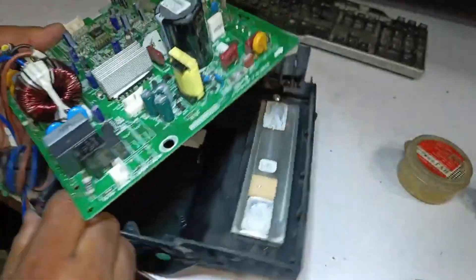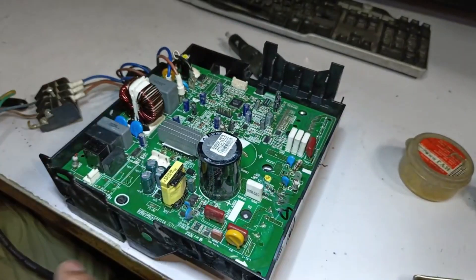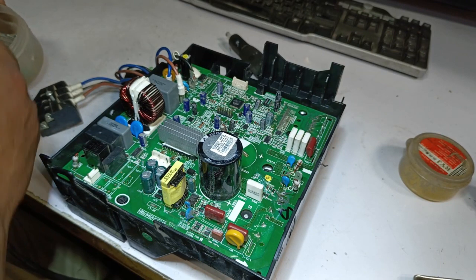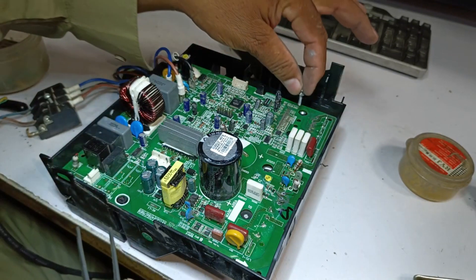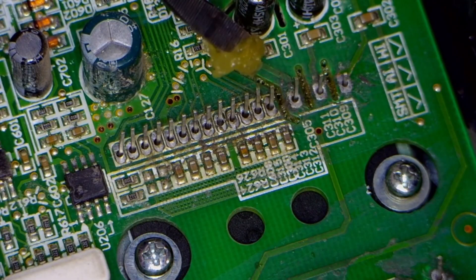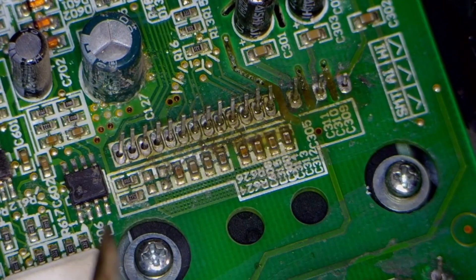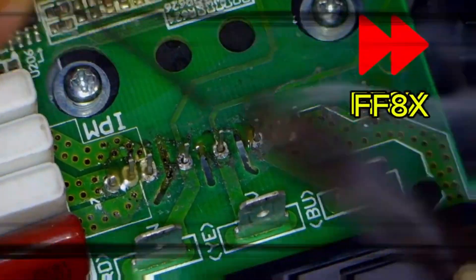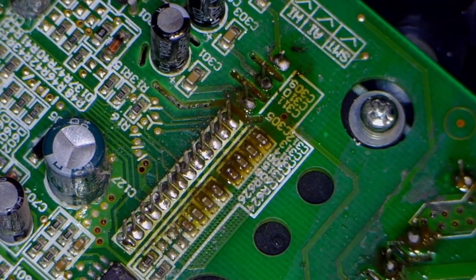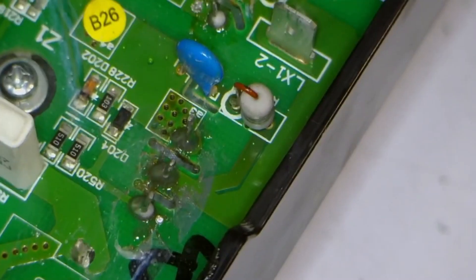I have placed the diode and IGBT back in their positions, so we will now reassemble the circuit. We will tighten its screws with the heatsink — this is a very important procedure. If you don't follow this step properly, your IPM and the other components won't last long. Now, we will solder all the pins. Before soldering, we apply paste here, because with the paste, the pins get soldered properly. All the points have been soldered and look good, and the other components have also been soldered.